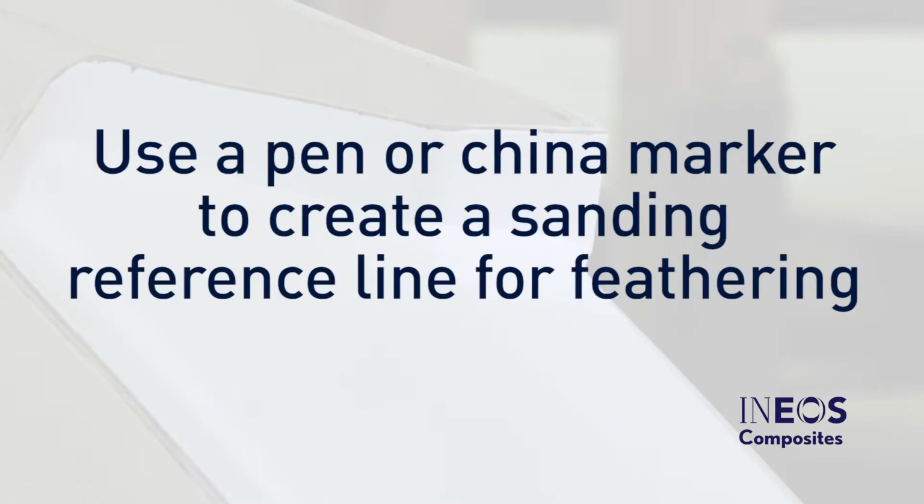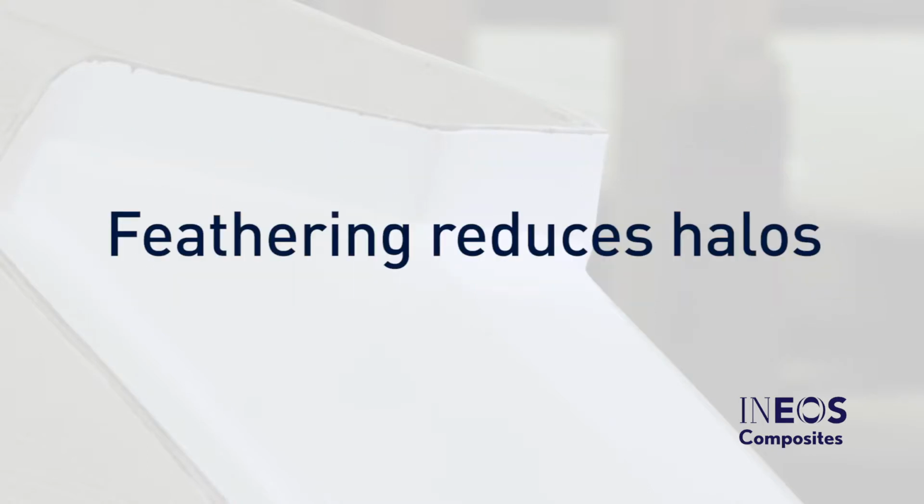Using a ballpoint pen or China marker, draw a line just outside the sanding line. During sanding procedures, this line will indicate when the edge of the patch has been reached. When this line has been sanded out, the feathering of the patch edge should be nearly complete. This step will remove halos caused by incomplete sanding procedures.